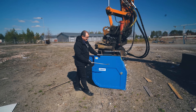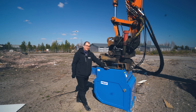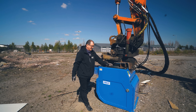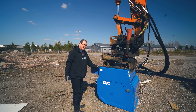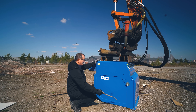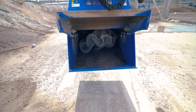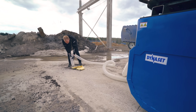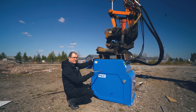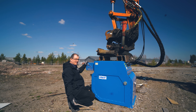The airflow is created by this area here, which is the air turbine — a hydraulic-driven air turbine. It's essentially a big fan. The airflow created will go through the trash tank, either coming in from the hatch or from the manual hose. It will then go through the turbine area and out of the exhaust arrangement.